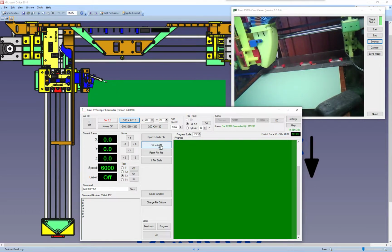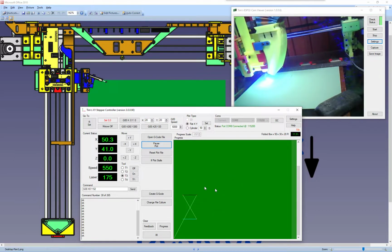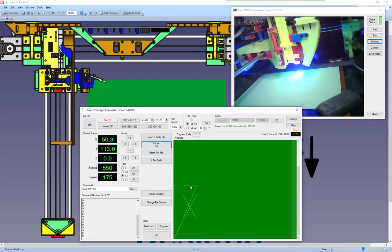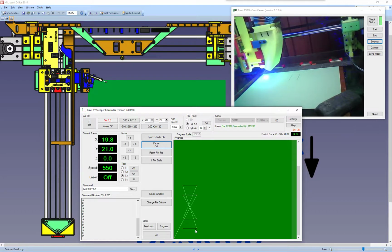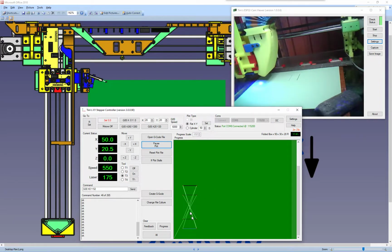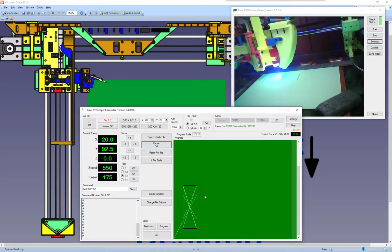And we just click plot. There we go. So you can see the progress down there in this progress window. And basically, there's sort of four commands here. The four colours. The blue and black: blue is I've sent a G1 command, and the black is saying it's done that command. And if they've got a light pinkish colour, it's a G0 command. Then when it turns green, it's done that G0 command, and so you can sort of track how it's going.